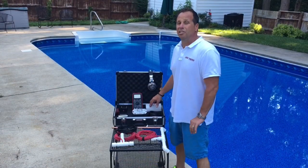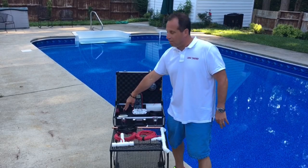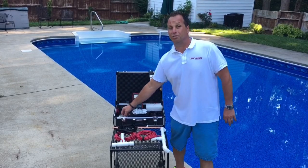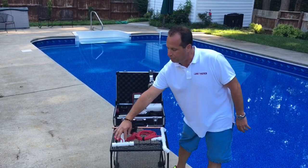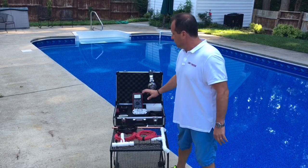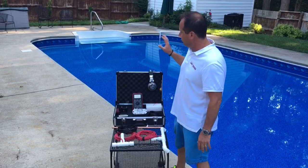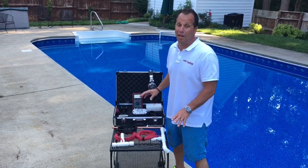We're here to introduce the Vilo — the Vinyl Liner Leak Locating Unit made by Leaktronics. It comes with a sender which sends a square voltage through a float into the pool, a receiver that works with the LT-1000 with two probes — one for walls and one for floors — plus a meter, headphones, and a case.